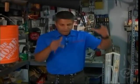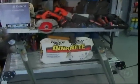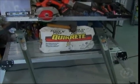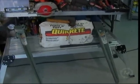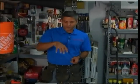Simply what you do is you use your post hole auger or manual clamshell auger. You dig your hole. You take this bag. You cut it open. You dump a bag or two, depending on your depth, into the hole, and then you add a predetermined amount of water, the amount of liters, whatnot, it's on the bag. You add water on top of the dry mix, let the garden hose run or measure it, and then somehow, miraculously, this water soaks through and it solidifies the product, turning it into concrete.